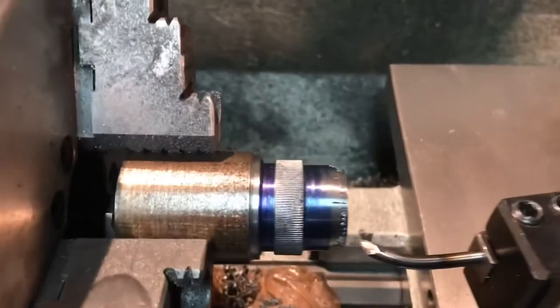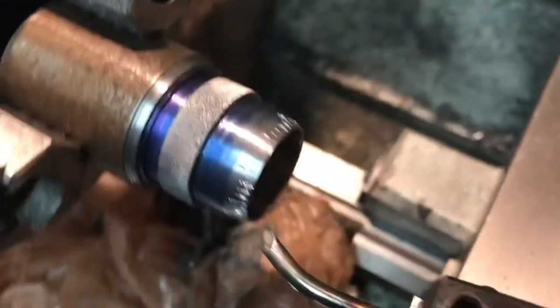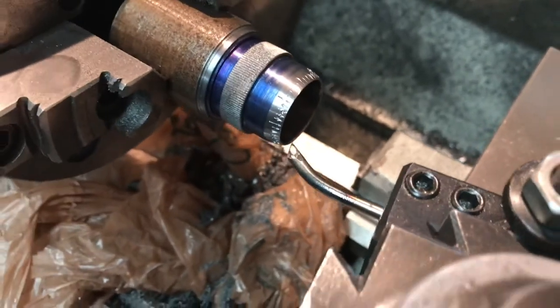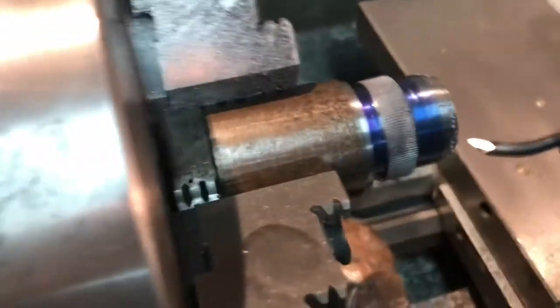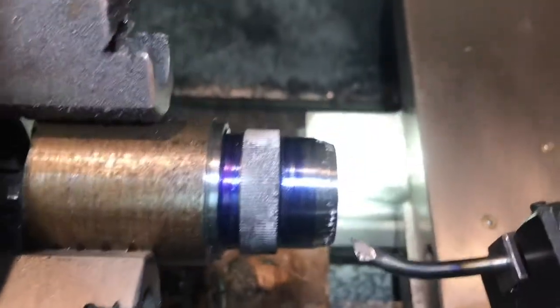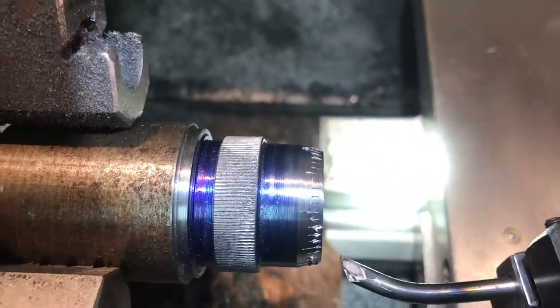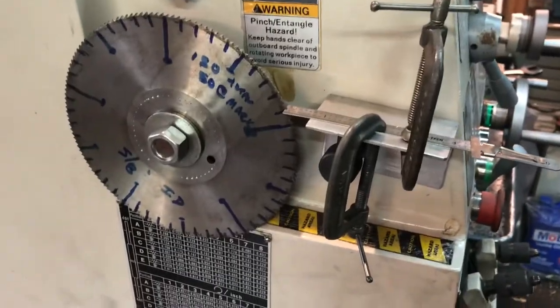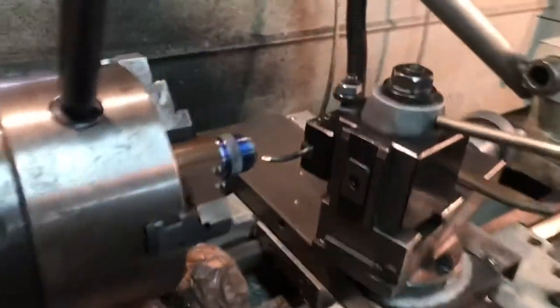Just wrapping up — I finished marking and indexing the 50 lines on the thimble and I'm pretty happy with how it came out. I ended up making a 15-degree angle instead of 30 so I had more real estate to work with for cleanup. Here's my little setup, just like Winky's Workshop. Now I just need to clean it up and part it off.